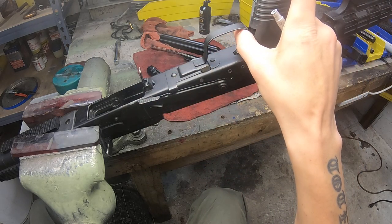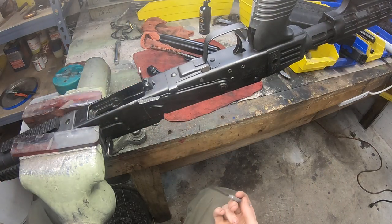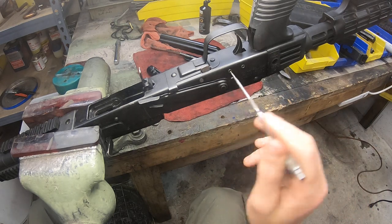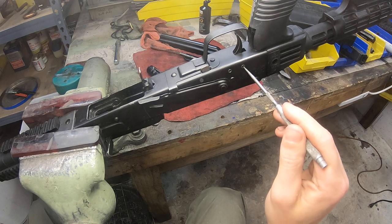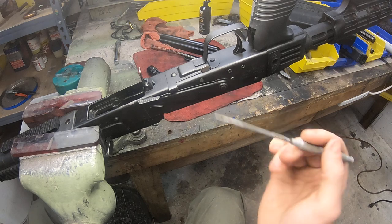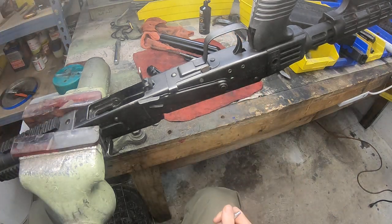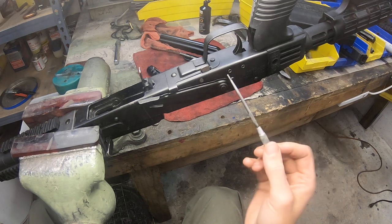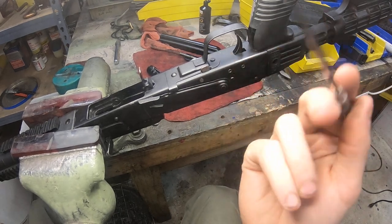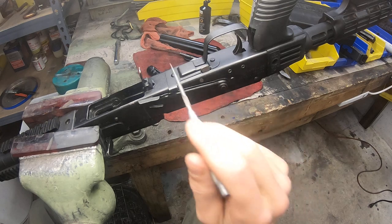Mushy. I almost hear the grit. And I've done a fair few conversions. It's just driving these pins out, which is not hard because they are just basically open-ended pins that are flared out to hold in place, because the other side is more like a rivet. And you get a small enough punch — not a scribe — make a small enough punch in there and just drive it all the way through. And you get to take all the guts out and then remove the rivets.